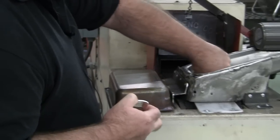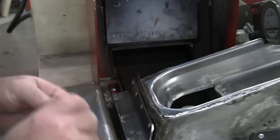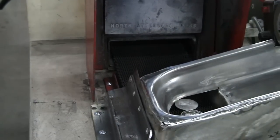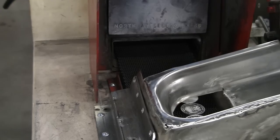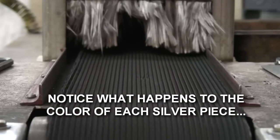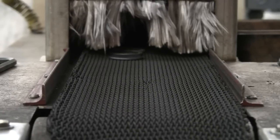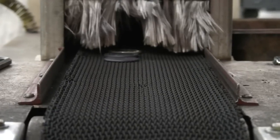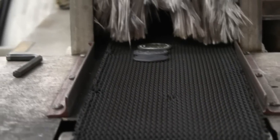First the dollar, then the sterling, and now our three nines fine silver. These are three pieces of silver. The furnace runs at about 1600 degrees Fahrenheit and takes about five minutes for the silver to go through. We want to get the silver to at least 1000 degrees Fahrenheit to be able to anneal it.